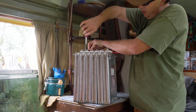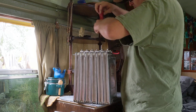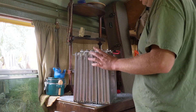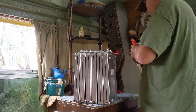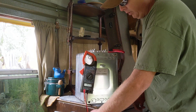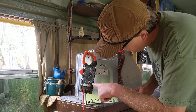I'm not going to add the connections for the charge controller or the inverter right now — that'll be in a video right after this. Right now we're just going to end up with a 24-volt battery with twice the capacity, somewhere around 2.2 to 3.3 kilowatts. Don't order your modules at four different periods spread out over four months from different cars with different mileage — I've got different voltages in my modules and they get off more than if you ordered them all at the same time.